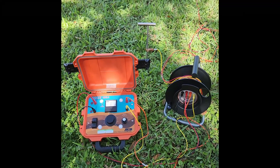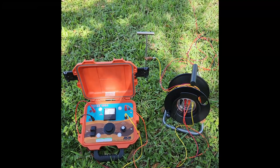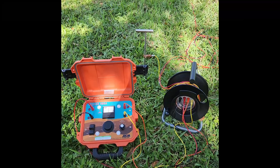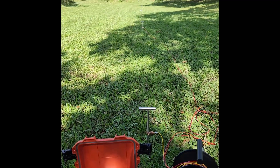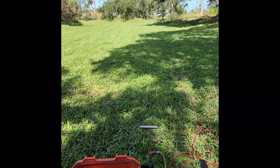This is the Miller 400A analog resistance meter and today I'll be showing you an example of the four-pin Wenner method test. I'll be using the four-pin test reel. I have the lead stretched out and connected to four 18-inch soil pins that are spaced out at 15 feet, so that will be our target depth of 15 feet deep.